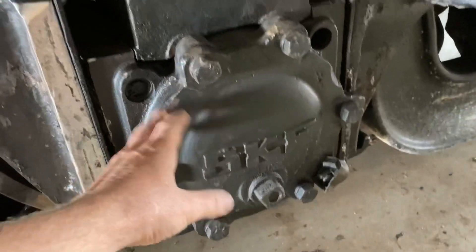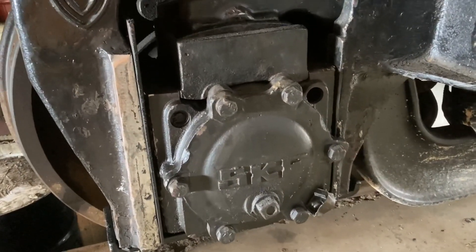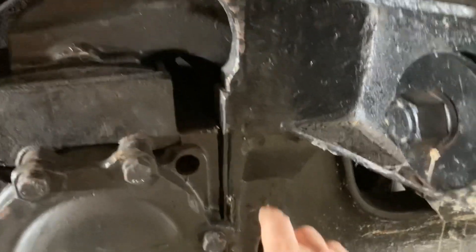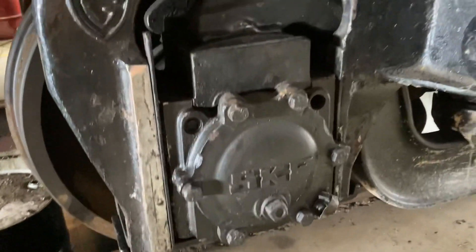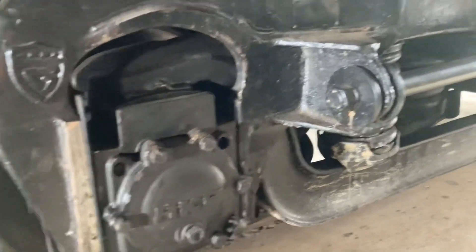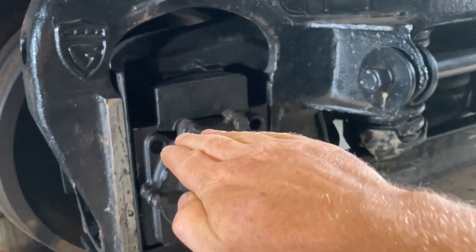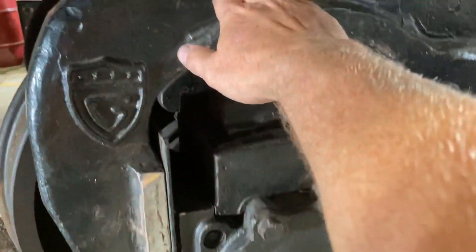What we found is this car was sitting for so long that the journal box wasn't sliding in the pedestals — they were frozen. So what we had to do is jack this up and replace this liner, right here. That's the other liner there. We only need to replace one because ice had gotten in behind it, bubbled it, pinched the box, and the box couldn't ride. Essentially, if you've ever had a model train derail, it's probably because the track was not super level and the truck does a three-point landing because this doesn't float. The reason these stay on rough track is because the journal box can slide up and down away from the truck frame.